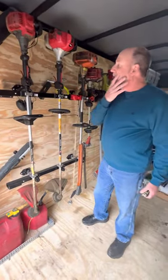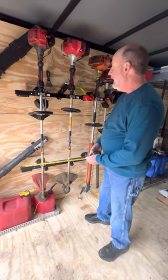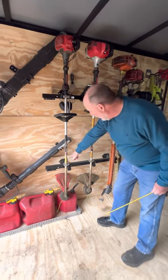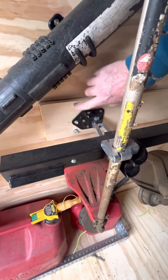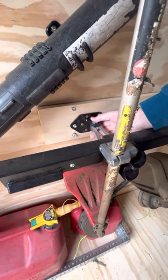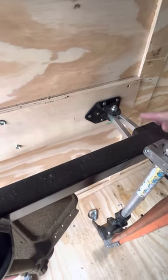Focusing on this Equipment Defender rack — you use the same brackets. What I did is there's a stud coming right down through here, and if you can come in and focus right here, I screwed this three-by-three-quarter piece of plywood to the plywood on the walls and caught the studs here. The middle one is also catching this bracket.